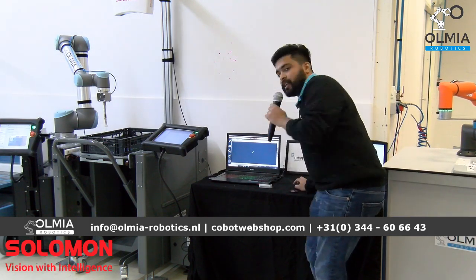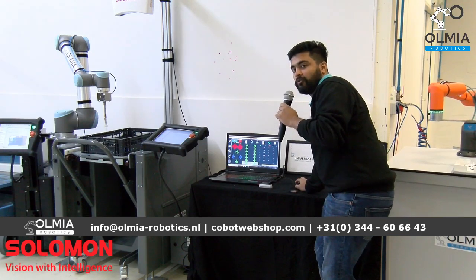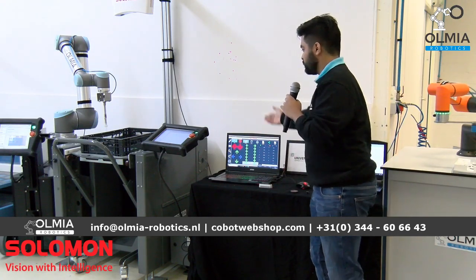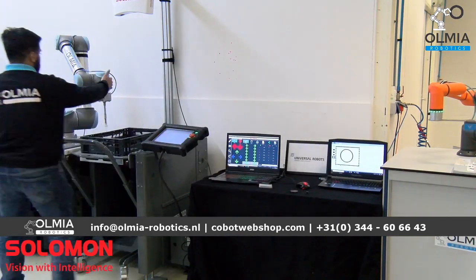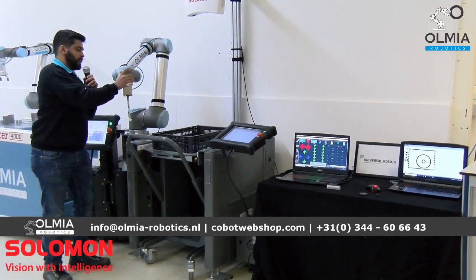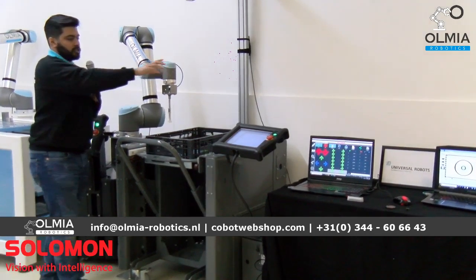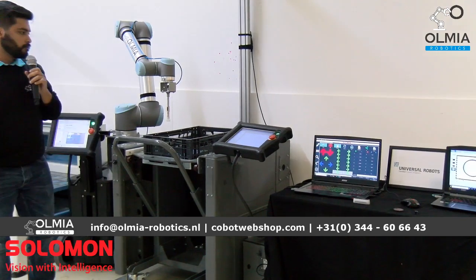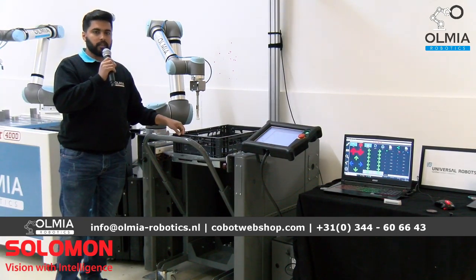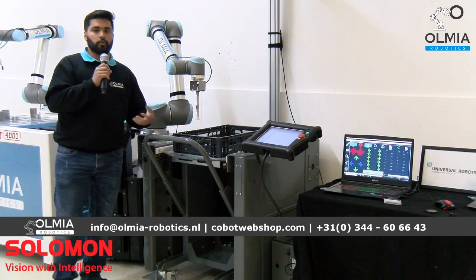As you can see, their software also includes integration with the robots — you can move and program the robot without using the teach pendant. I'll show you a quick demo: if I put the mode in free drive mode I can move the robot freely, set the pick position and place position, then make the program in the software, press play, and move on. In today's application we're going to show you a random bin picking application, mainly used in logistics, e-commerce, and warehouses for order picking.